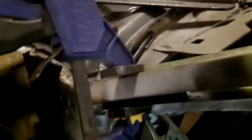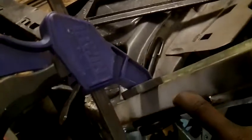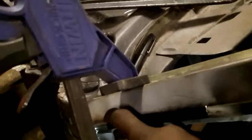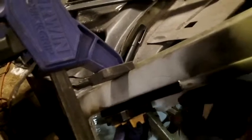To satisfy that second plane, I looked at the edge here. I couldn't read a measurement directly because it was rusty before I fixed it, so I measured the good side using a machinist ruler. This gap needs to be 13 millimeters. The inches were harder to read, so I used millimeters. I also just lined up the top edge, and then the measurement I got was exactly 12.